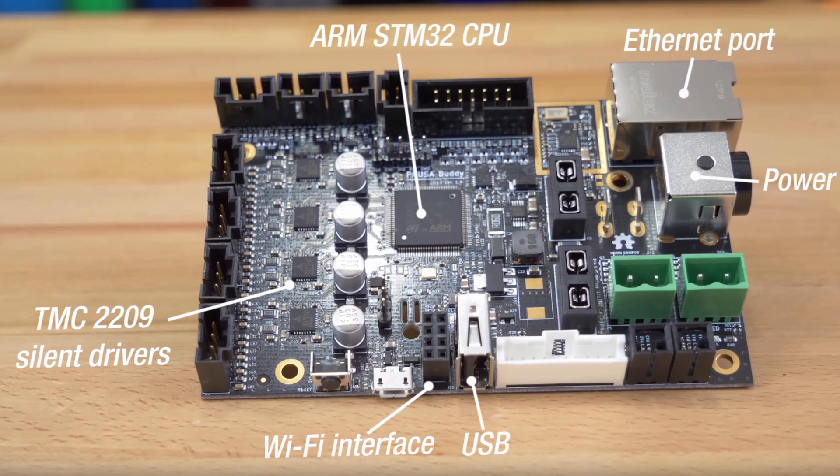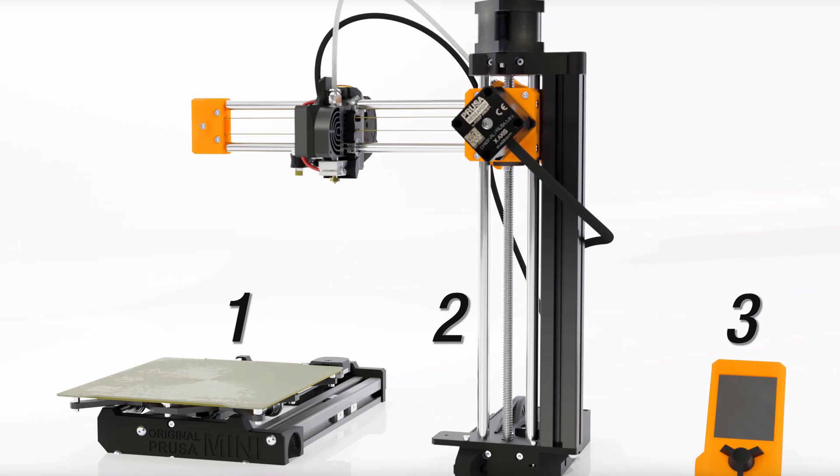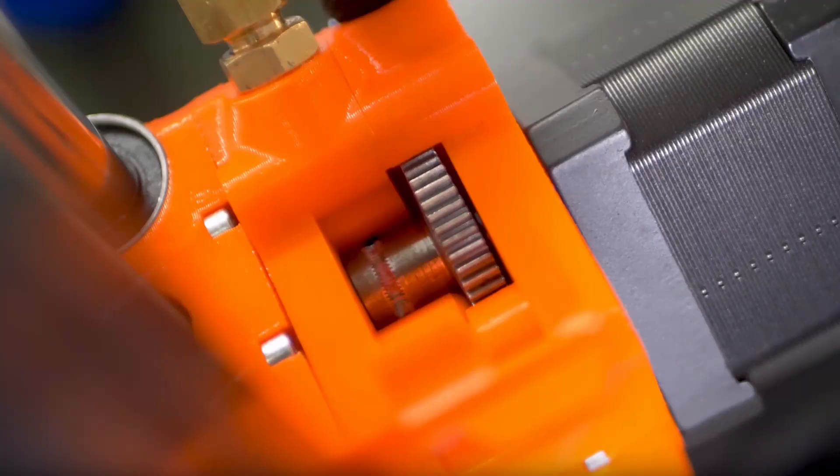So now I don't have to break my nails trying to get out that SD card — it's easy peasy. Easy assembly, and the filament holder has bearings to make sure you have no issues with spool heft and the filament path. The bed goes to 100 degrees Celsius and the nozzle goes to 280 degrees, so this is not just a beginner 3D printer — it's a versatile, hopefully headache-free 3D printer for the prototypist. Most of the time I print small parts, so this one will do just fine. It also features a 0.25mm nozzle for great detail.